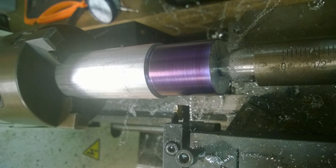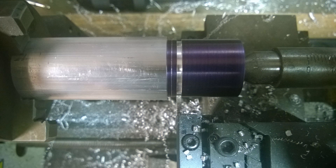Without me yabbing on — this stock is quite a bit bigger than we need. I basically put it between centers and turn the diameter to close to where we want it, which is just a smidgen under 30 millimeters. I get it close — I think it's about 30.5mm.